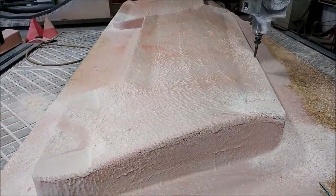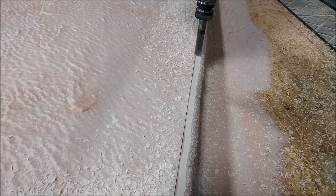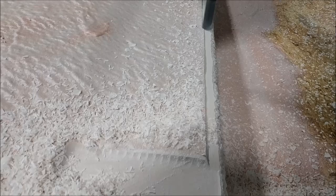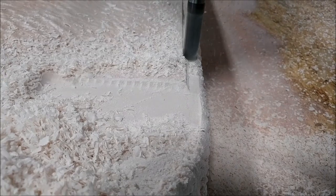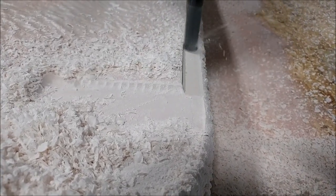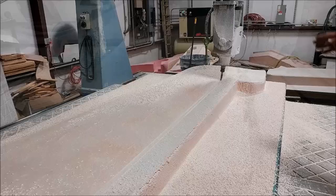Here's our left side lower wing skin plug up on the machine after having the putty put on. I've already run some of the ball mill passes on the transitions and corners, and this is just starting out on the flat mill pass — you can see how the flat mill pass meets up where the ball mill pass had already run on the corner. That pretty much ran all of Friday evening, and then it needs to be relocated or slid down.